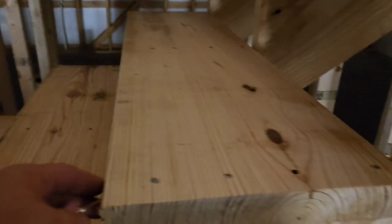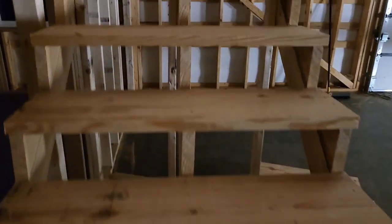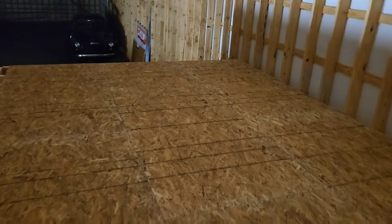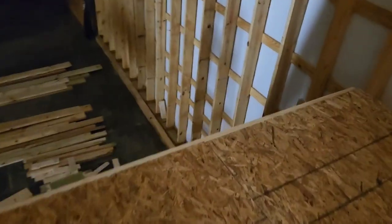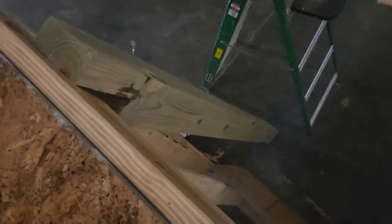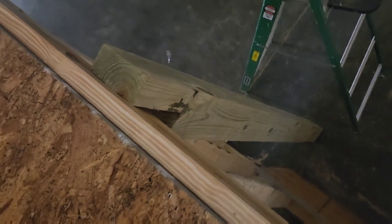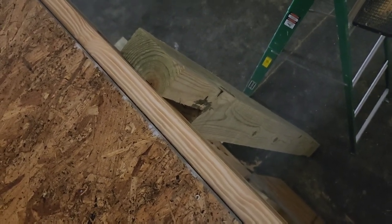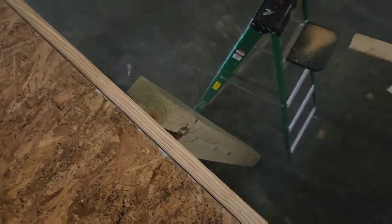Everything is glued and nailed — three-inch nails, four on each stringer. Got the platform in, glued and down. The next thing I got done is I scissored in the rim joist on this edge. I'll show you the top of my 6x6 posts — I did get them notched in. This is going to be on the outside to match the other side. I'll be running a double on that beam.